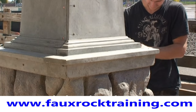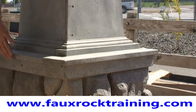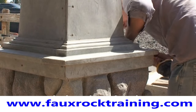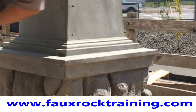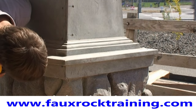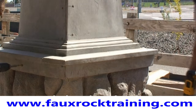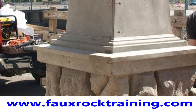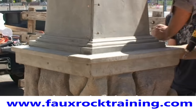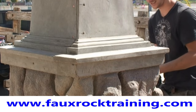At this point they're finishing the last column and then they'll start caulking. For the square tapered column we're using a white latex acrylic caulking, smoothing it out. For the river rock column underneath in temporary installations, we use a gray caulking — essentially a mortar caulk, though regular acrylic latex works fine. After that it'll be dealt with using our hydro seal, a cementitious paint applied right on top of the gray caulking wet on wet. Once all the fasteners are employed, you're tasked with covering them up.